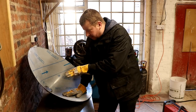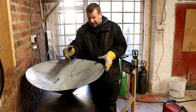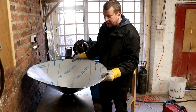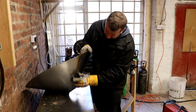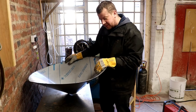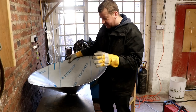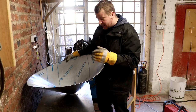All the cones are now tacked up into roughly a conical shape. Because I didn't back purge during the tacks, I'm going to go in and clean the tacks up on both sides, being careful not to remove the tack itself so they hold together. Then I'll attach the purge bar to one side and weld up the other, then swap round, reflow the inside of the weld with the purge bar on the outside. Once all of that is done I'll try to form them into a nice round cone - there's no point beating them into shape now and putting a load of heat into the steel causing distortion.